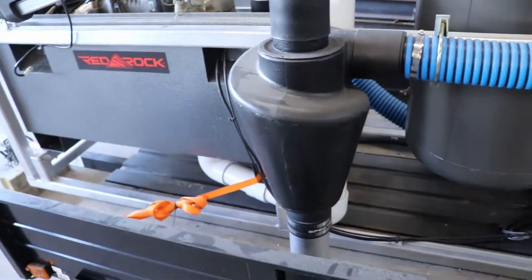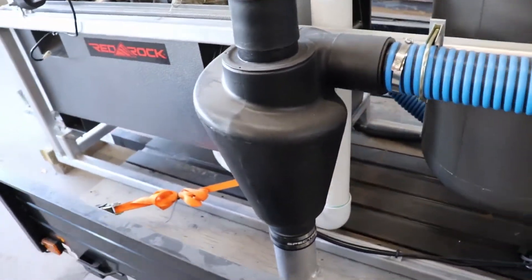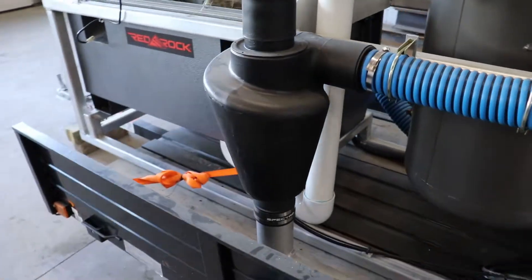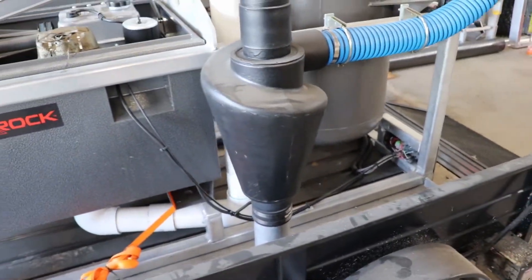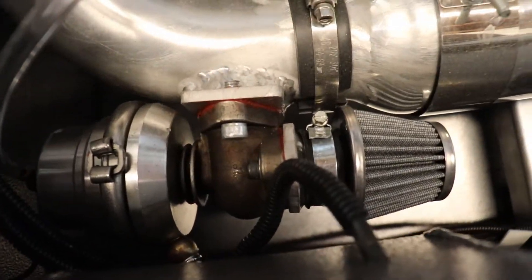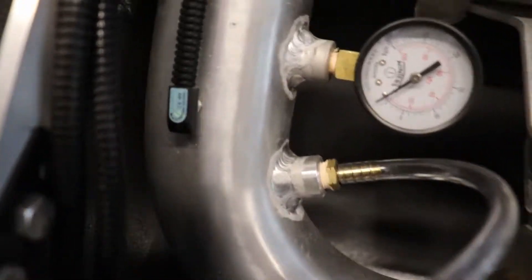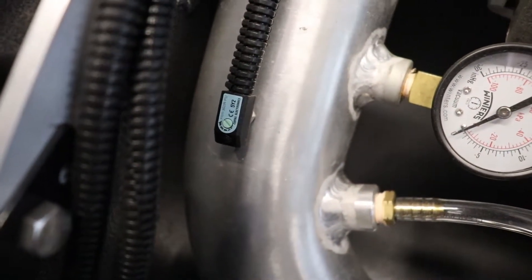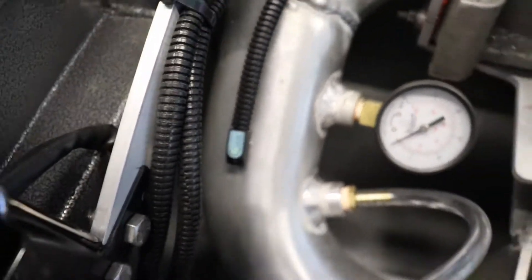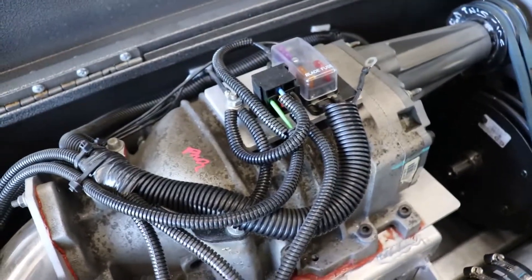This cheap plastic cyclone — I think it's fairly likely that it will fail under any substantial vacuum. Dust collection systems don't really pull any actual vacuum; they're more about moving air velocity. So that will probably fail. If that doesn't fail, hopefully this wastegate valve kicks in in a high vacuum situation. And if not, we also have an electronic cutoff — just a pressure switch, adjustable — wired through a kill relay which shuts the engine off.